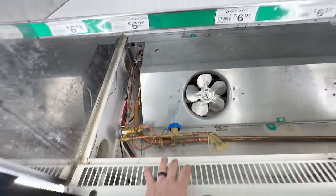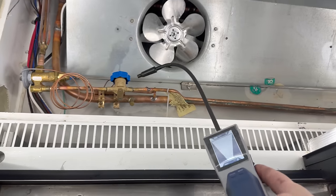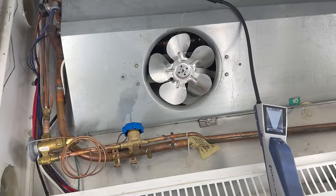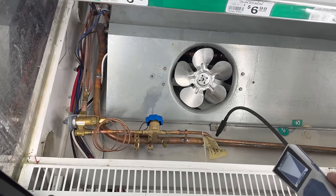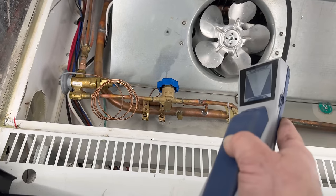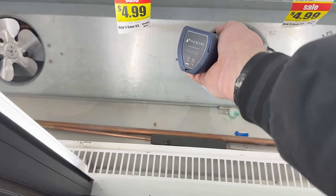One good thing to do right now while we've got it is go ahead and do a quick leak search — just make sure there's no leaks. Right now is the perfect time to do it, everything's warmed up. Let's go ahead and open this up and get some flow. Notice that bulb wasn't flat because it was on the curve a little bit — it's only off by a little bit, but that's enough to throw your superheat off. So went ahead and readjusted that. A lot of times those will leak there because they clean them and end up not getting tight. I'm not going to say you're going to get a really great detection here, but now's the time to do it. I've been able to pick it up in the air band if it's a worthwhile-fixing-type leak.